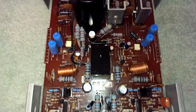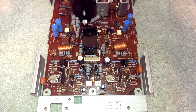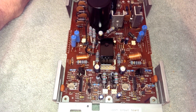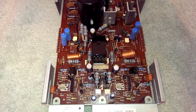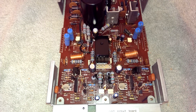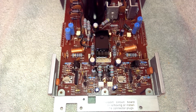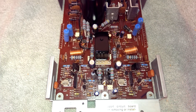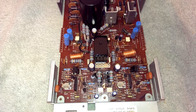What's unfortunate is that cap that's now taken out. I thought it was the timing cap for the protection circuit. The reason I thought that was because it was colored orange and it looked like, at first glance, a low leakage capacitor. On the Kenwoods, they use a fairly large low leakage cap as the timing cap in an RC circuit for the turn-on delay. That's not what's going on here. The reason that cap was orange was to denote a special feature — not its leakage, but its temperature rating. It was not 85°C, it was not 105°C — it was rated at 125°C. That's a bit unprecedented in consumer electronics. I've never seen that before in a piece of consumer gear.